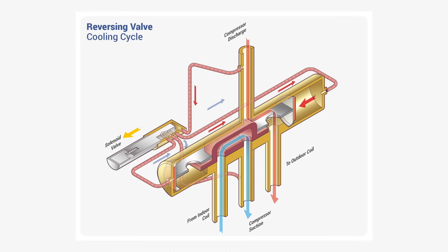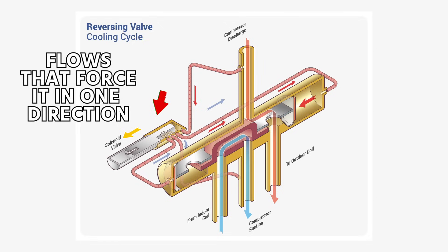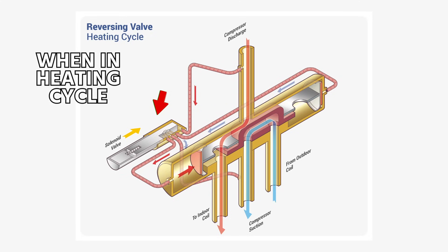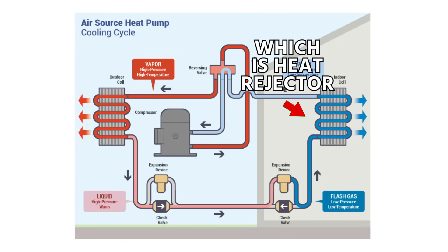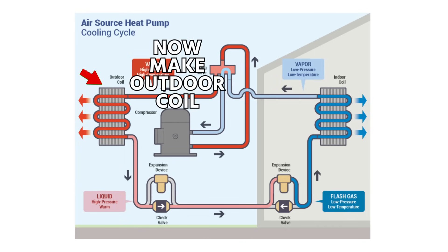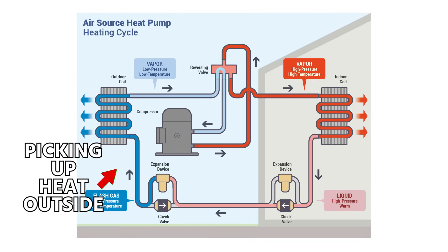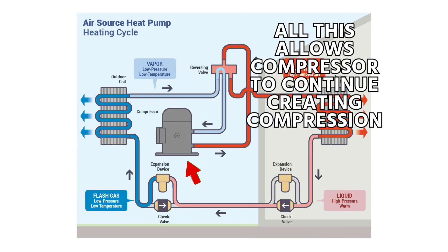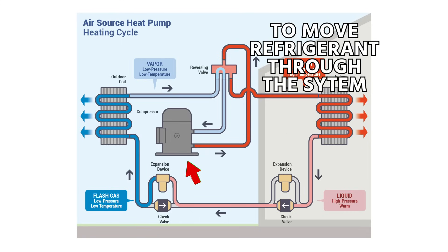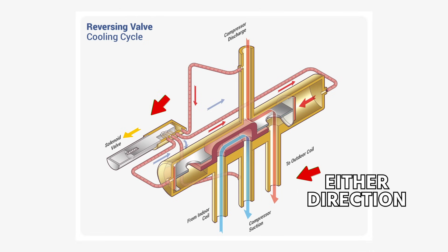Here is a static image showing the operation of the solenoid valve and the flows that force it in one direction during the cooling cycle and in the opposite direction during the heating cycle. The point is to take the indoor coil and make it the condenser in heat mode — the heat rejector — and make the outdoor coil the evaporator coil, which is the heat absorber. In heat mode, you're picking up heat outside and rejecting it inside, creating a heating effect for the occupants. This allows the compressor to continue doing what it does — creating compression to move refrigerant — while the valve interrupts and redirects those flows in either direction.